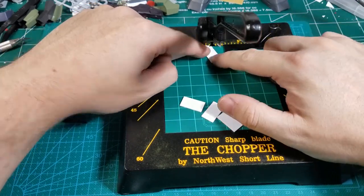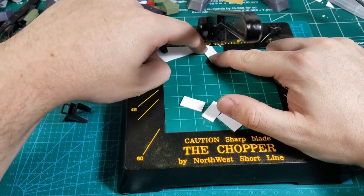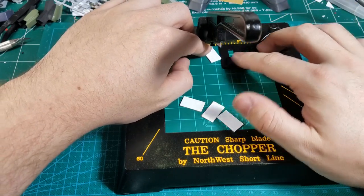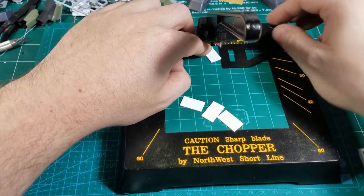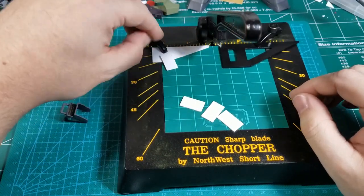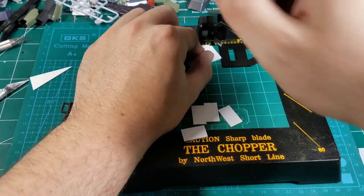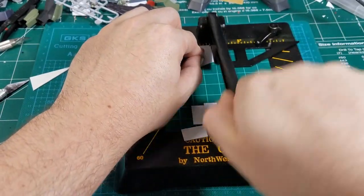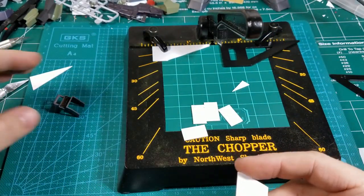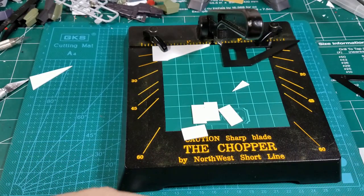Slide this guide in, making sure that the piece is flat right here, nice and tight. I'm going to move this guide up until it touches the piece, and then tighten the guide down. I'm going to use a test piece and just chop. Let's see — how bad did I do? Yeah, that'll clean up in sanding.